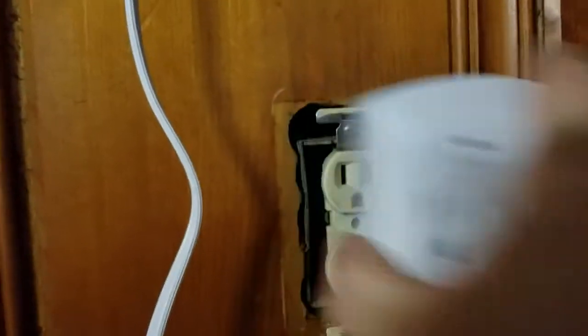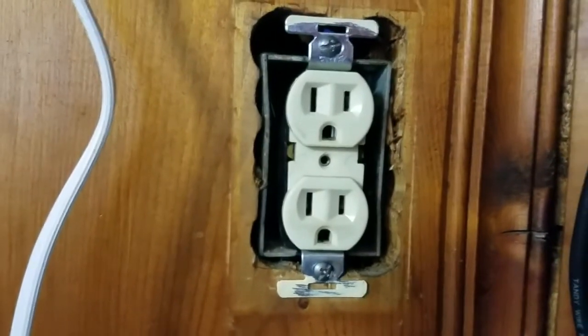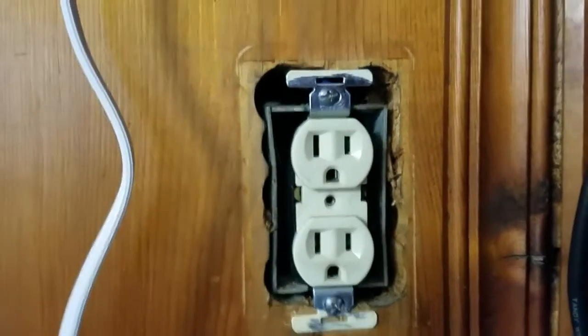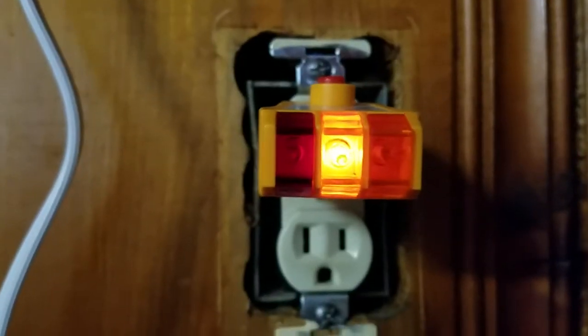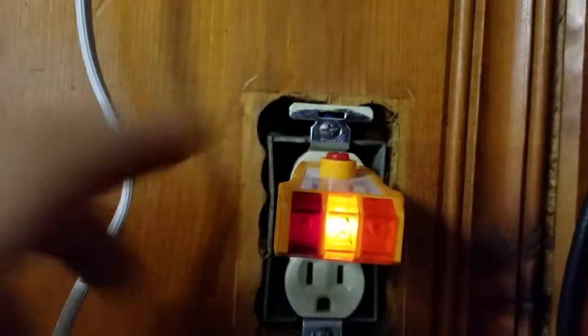Let's pull this off. Now here's my outlet. There's no ground on here because this is all controlled by the GFCI on the first one on the circuit. So if we go here, look at that — that's an open ground, it should say on there. But trust me, it's an open ground. That's what we got.